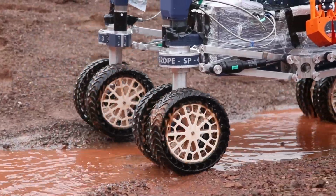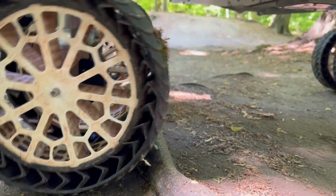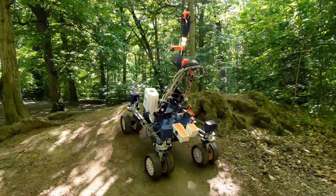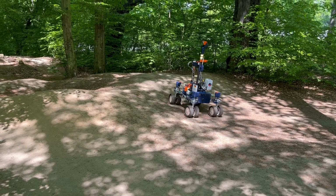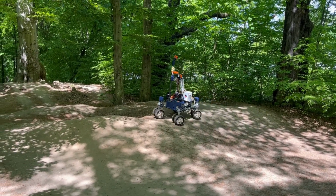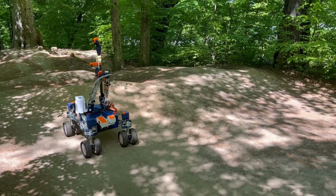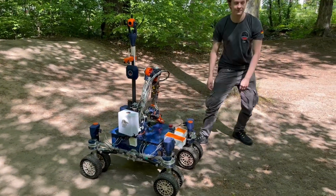The design of our double wheels is also well proven on previous rovers. We simply made them bigger to have better rollover. The diff gear at the center of the BEMA still makes sure that there are always at least 3 wheels touching the ground. This allows us to drive on many types of terrain. And of course, the e-stop still works with 48 volt.